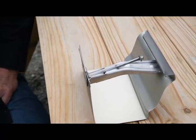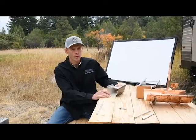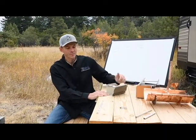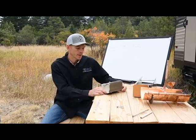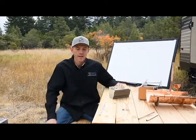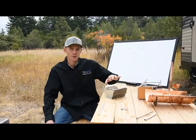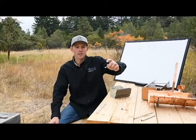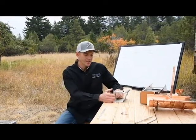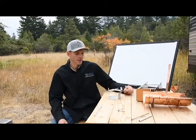The next step up is the hang fast hanger, also a Raytech hanger. These have a built-in screw ready to go from the factory, which is nice. They are quite a bit more expensive per hanger, but they come with the screw and save you a bit of installation time. Some customers request them or prefer them because they have a little more contour, making them hold up a little better. The screw is pretty beefy and allows for expansion and contraction, whereas with standard screws you often see screw heads breaking off from temperature changes. It just pops on the back of the gutter and the built-in screw is ready to go.